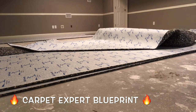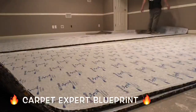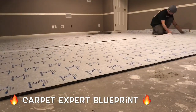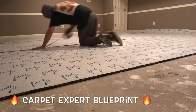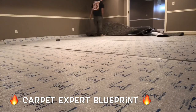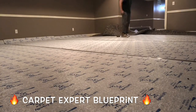There are a number of different ways you can adhere the padding to a concrete subfloor, but in this video we are rolling with duct tape. We're going to unroll all these shots, get everything rough cut in, and then tape all the seams. I'm using a vapor barrier padding — moisture padding — whatever you want to call it, so the carpet slides real nice.